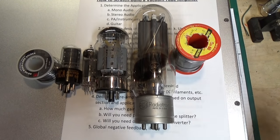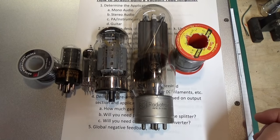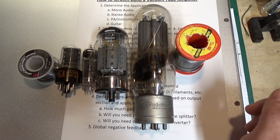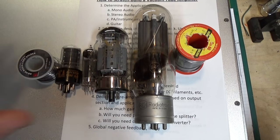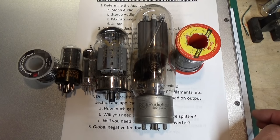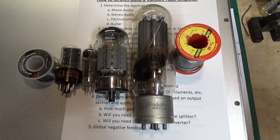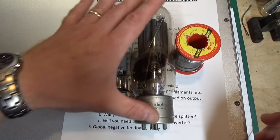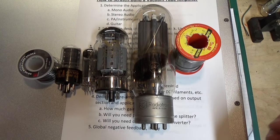The 845 is really not a very high-powered tube compared to the others — it's not as efficient. By not being a tetrode or pentode, they don't have the same amplification. However, being a triode with very few elements, these have a very beautiful sound and are treasured for that reason. There are also the 300B, Western Electric 300B, 811s, and 2A3 — all started out as transmitting-type tubes and are valued for how pure the sound they produce when used as a single-ended amplifier.